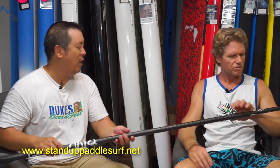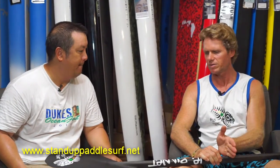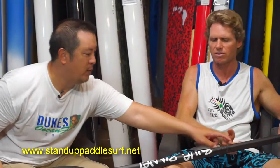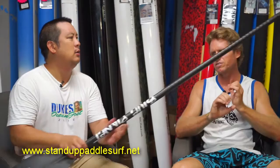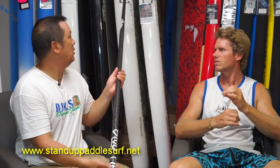For length adjustment, this prototype is glassed together as an early prototype — we still have to finalize the ferrules. But basically, this top piece is one piece, and then there's a ferrule that slides into the middle piece. You cut it right at the bottom of the middle piece. It has a constant diameter section where you can cut it to whatever length — you always cut between the knobs, not in the middle of one. Because of the oval, oblong shape, it keeps the ferrule and paddle from twisting, so we're able to use hot glue to put them together.